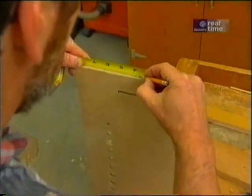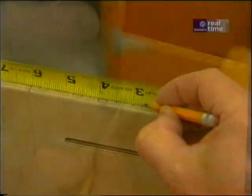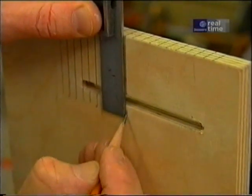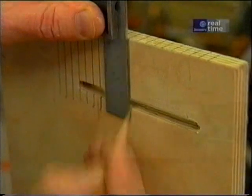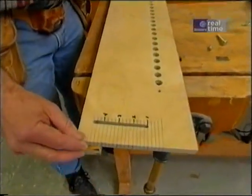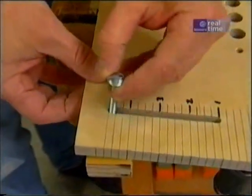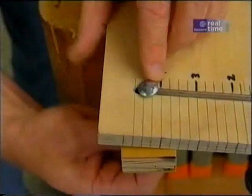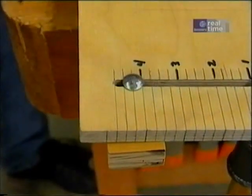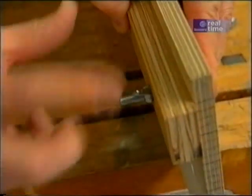For a reference, I'm going to put marks every quarter inch at each end. These vertical lines will make it a lot easier to adjust the stop. To attach the stop to the main part of the jig, I'm just using a quarter-inch carriage bolt. We'll drop that down through the slot and spin it around so the square part of the carriage bolt is in the slot. Take a wing nut and use that to lock it down.